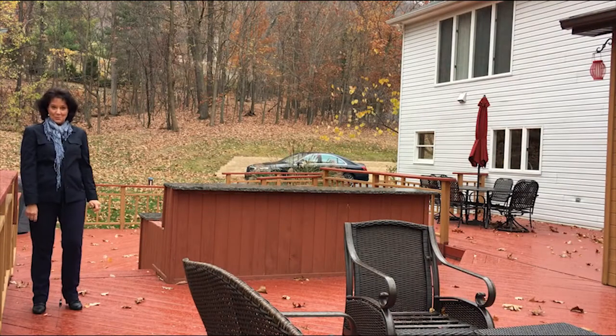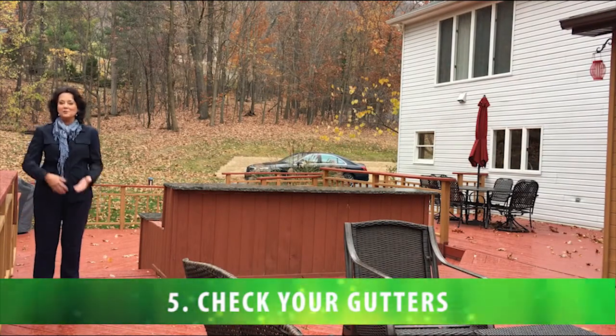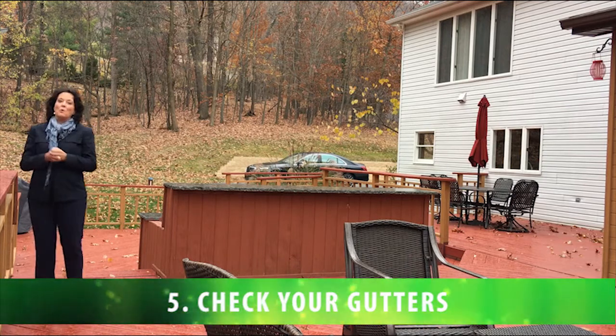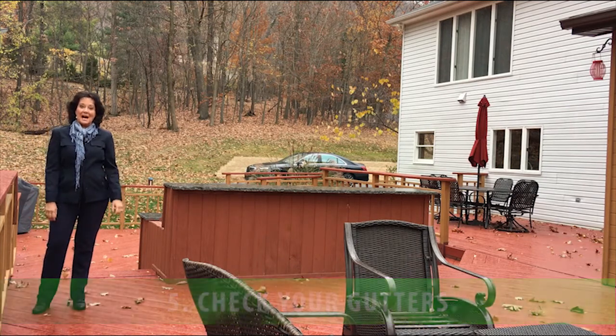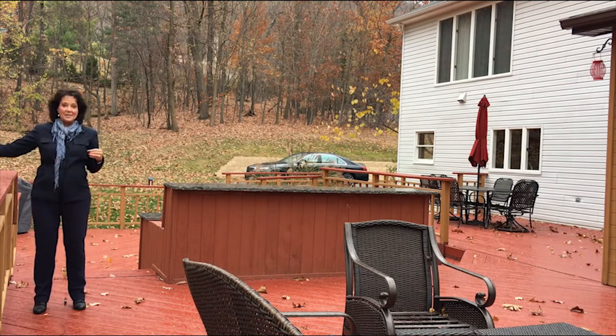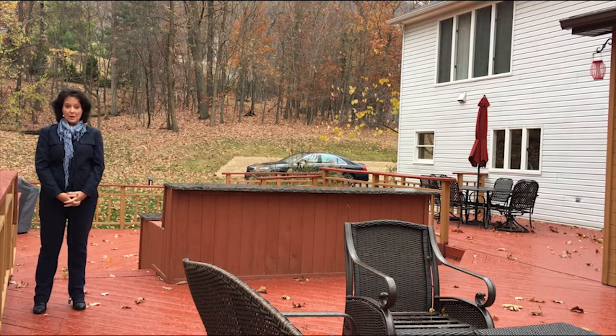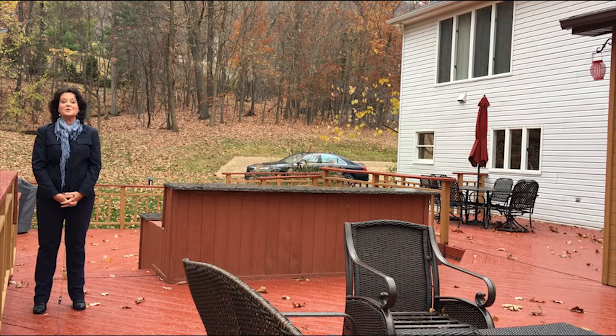While you're looking at your roof, also check your gutters to be sure they're clear. If your gutters are full of leaves, water can back up against the house and damage the roofing, siding, and gutters, and cause leaks and ice dams all over the place. Make sure that the water in your gutter isn't just poured out next to your foundation. Add extensions to your downspouts to divert water at least 3 to 4 feet away from the foundation. These are inexpensive and easy to attach.